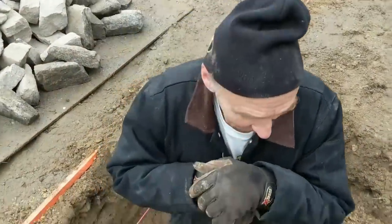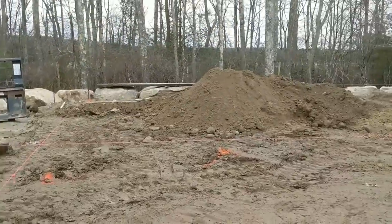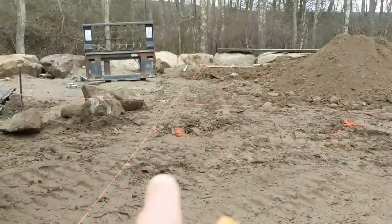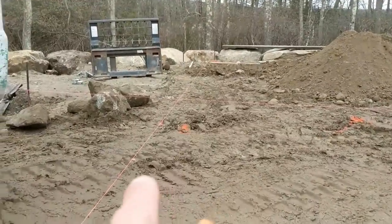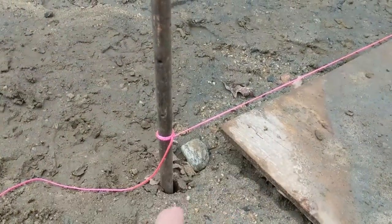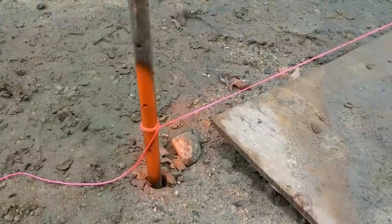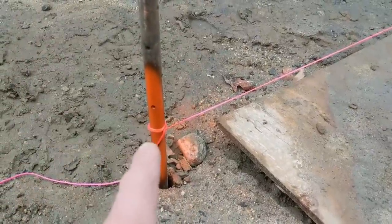Joe, why in the world are you hand digging at your age? Because everyone else around here is lazy to hand dig and they put the old guy in. Right now I need to get rid of that pile of spoils, so I need to take down this mason line. I'm perfectly square, so I need to make sure I tie my mason line at this elevation and on this side of the pin. I put a paint mark there — once I untie that, I have my mark and I won't lose it.